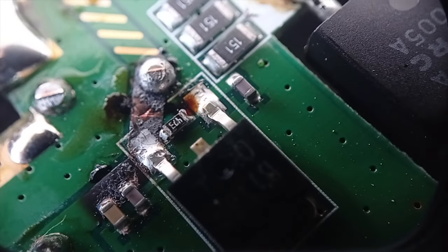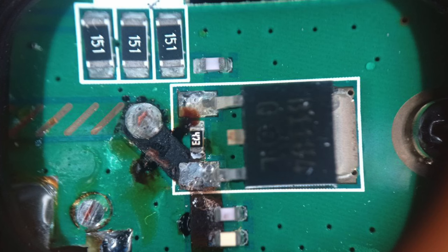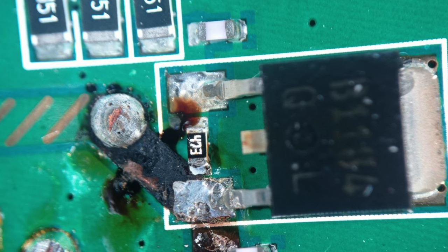What we can see now is a voltage regulator that is damaged. So the reason the radio won't switch on is there's no power supply reaching the board. It's not really a big problem, but unfortunately here in Panama it's very difficult to buy parts. There's no guaranteed result, and we don't have time for it right now. Maybe in the future I'll fix this radio when we have good access to parts — for now I'll put it in storage and try to bring it back to life later.